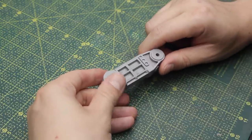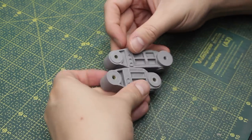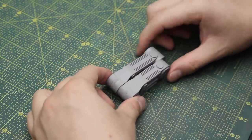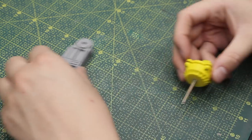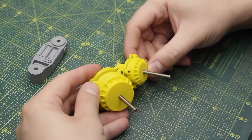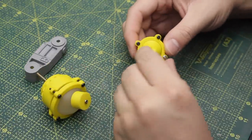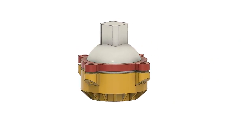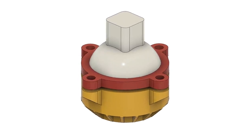But on the next day — and you can call me an insane person — I decided to restart the whole thing. I did that off camera. I started a new intermediate leg piece, and this time I was aiming to make something just a bit smaller. As you can see, it looks almost the same as the first one, but it's about 10mm or less smaller. I also designed this new smaller ball joint. It is much smaller than the first one and it also works super well. Let me explain how I managed to make it way smaller: it has the same design features — a socket and a pressure ring — but the ball actually has the bottom kind of cut out, and with that feature I'm able to make the whole thing even shorter.